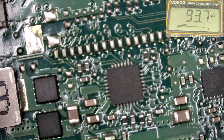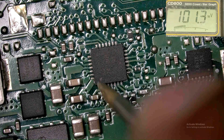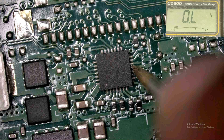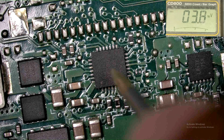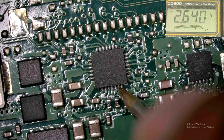Checking battery charging — this is the BQ chip. Here 19V input voltage is present. There is 3.3V, and this is the HDA. Voltage is present here, checking pin 6, which is the AC detect pin — that is okay.